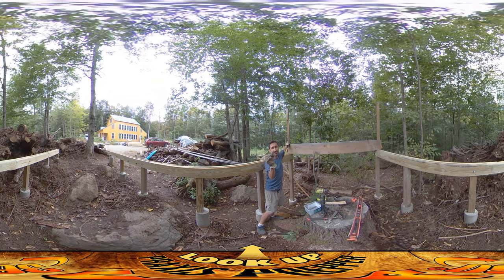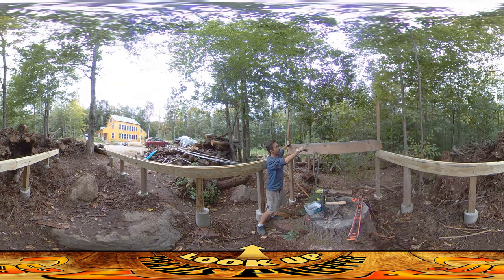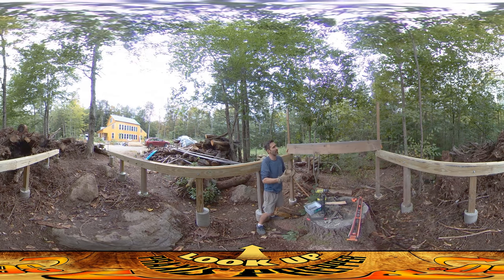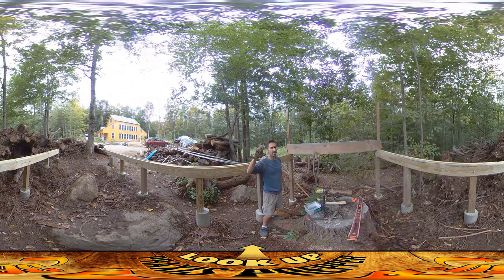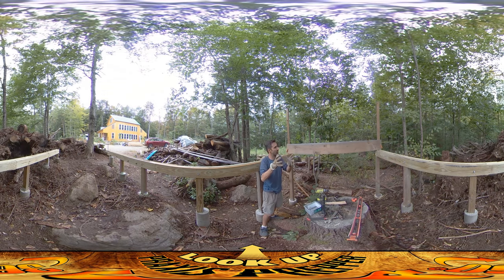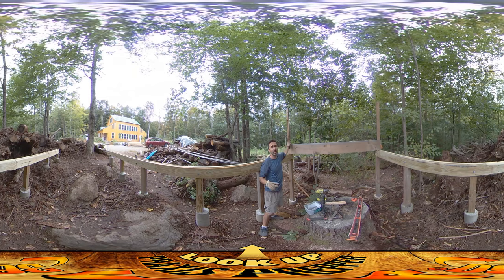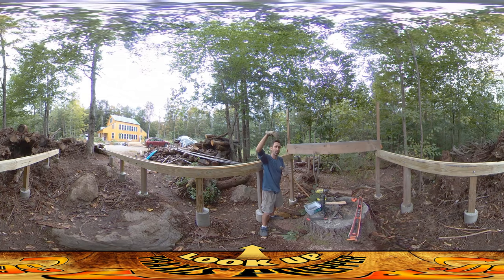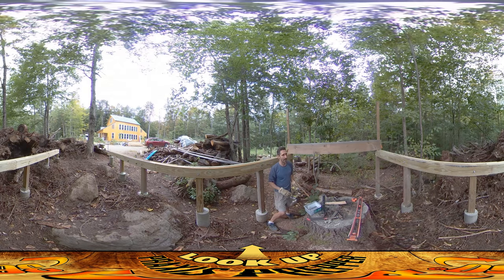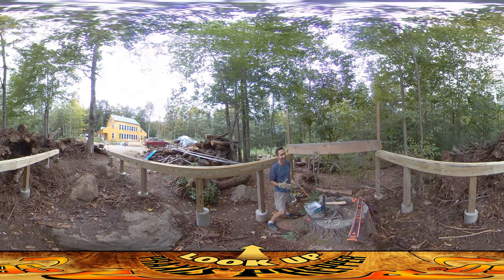The thickness of a 2x4 is one and a half inches. These boards are like 2x3s used in packing or packaging lumber — they're rough-sawn, so instead of being one and a half inches they're a little bit thicker. I've used these as spacers, clamped right here, so when I nail the boards in they don't get too tight together. When I yank these out later it'll leave a little extra room, making it much easier to slide the final post in. On my first house I wasn't that careful and some of those posts were really difficult to get in.